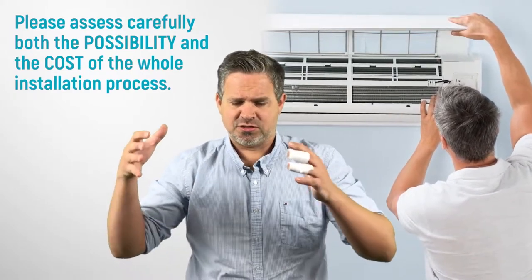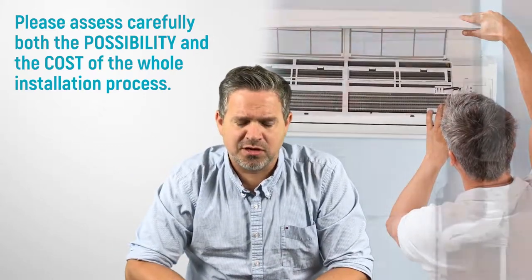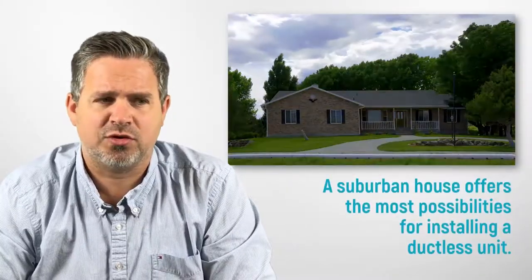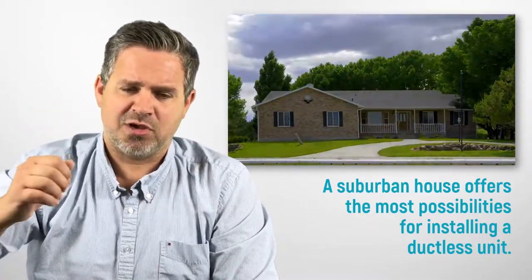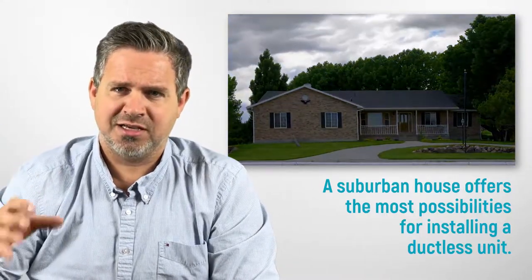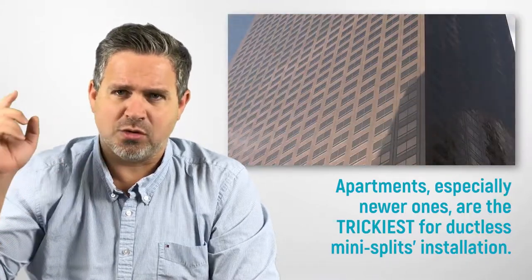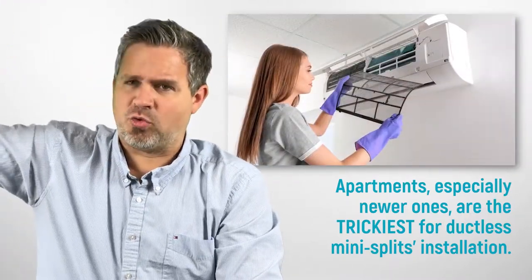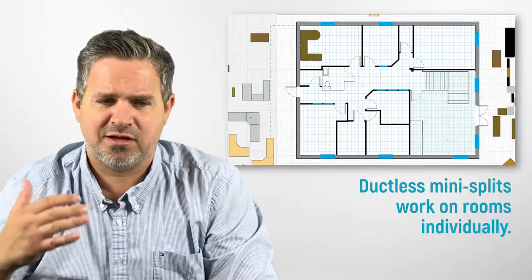As long as you can get one in — say you're in an older apartment that will allow a ductless air conditioner — great, we drill the hole and put it in. The other downside is that wherever we put one of those heads, we have to physically run pipes about this big around from the head back to the outdoor unit. In a house or townhouse there are lots of places to run the pipes — the attic, the crawl space — and we can hide them. But in an apartment, the challenge is where to cut holes and hide everything, so a lot of times you need to box in the ceiling corner, which can get quite messy.